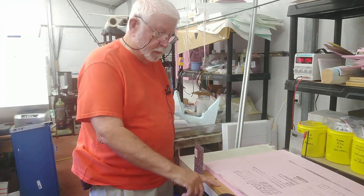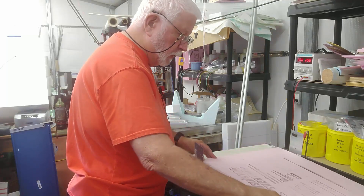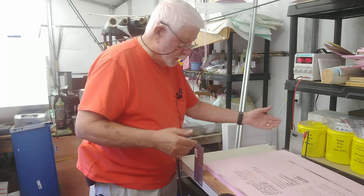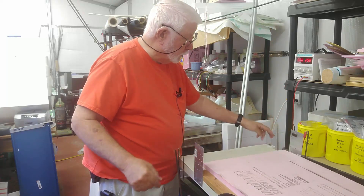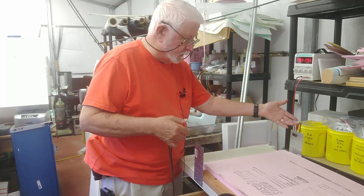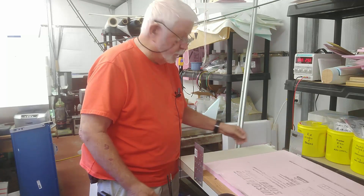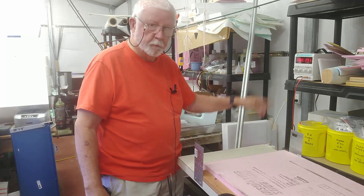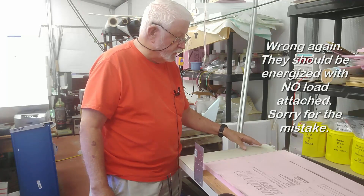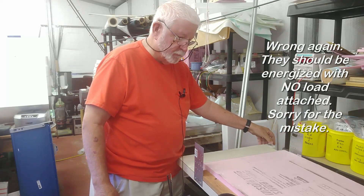All I've done is put a piece of blocking on the side just to keep this straight as I'm moving it under the hot wire — it's not absolutely necessary if you have some other way of keeping it straight. The power supply is on, but the switch that actually energizes the wire is down here. The first time you grab this wire when it is still energized will be the last time you grab it like that. Also, these power supplies usually need a load attached before you turn them on. I've got a small switch on the side, so now we're all set to make the first cut.